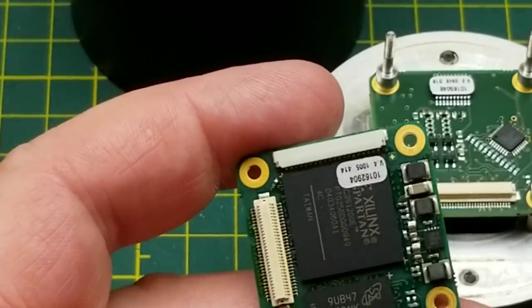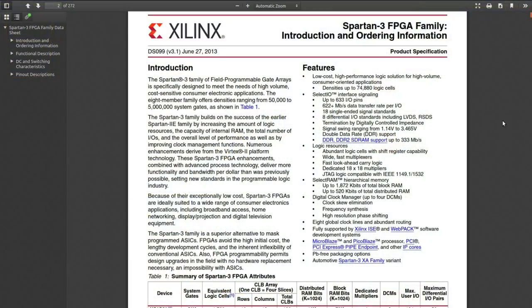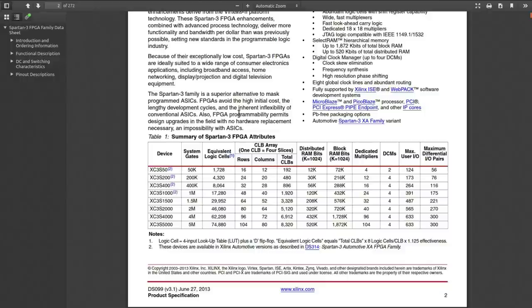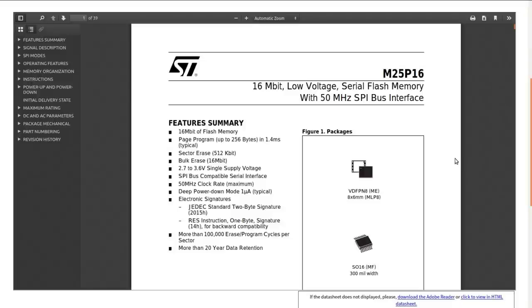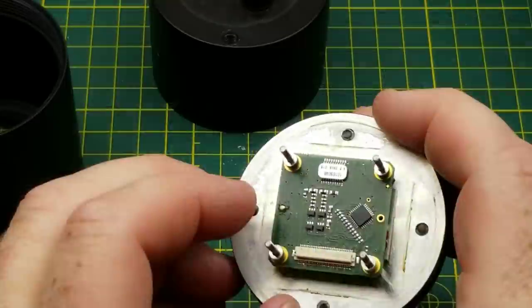There's not a lot of discrete circuitry — it's all done in dedicated packages. That big Xilinx chip is an FPGA. FPGAs are often faster than microcontrollers because they can be programmed to be a very dedicated function. This particular one is the XC3S1200, which would be 1.2 million gates. The date code looks like about 2009, which would explain why it's not showing up in the 2013 datasheet. And that little 8-pin ST chip on the back looks like a 16 megabyte flash memory.